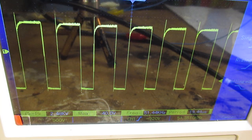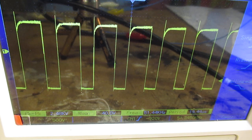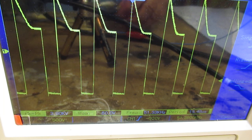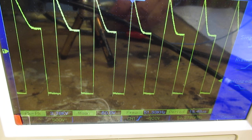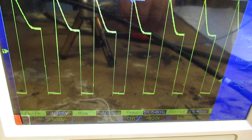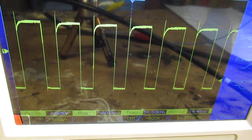So let me show that, and now remove that 220 microfarad capacitor. So you can surely see that when the voltage to the 555 chip is not completely good and stabilized and decoupled, the waveforms that the chip gives out surely change a lot. Anyway, clip on that decoupling capacitor again. One moment, please. So that was all kind of good waveform.